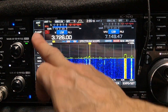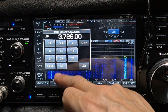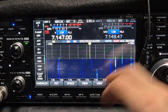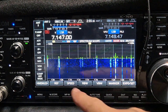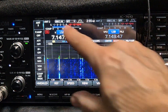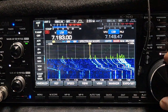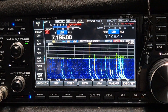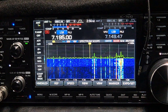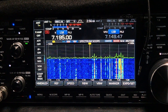Anyway, nice and clear there — that's the G5RV, that's the other antenna. Let's go to 40 meters LSB. Sounds a bit narrow. Right — 49-to-1 balun, 66-foot length of wire. That's the G5RV — it's pulling in more, you can see that.